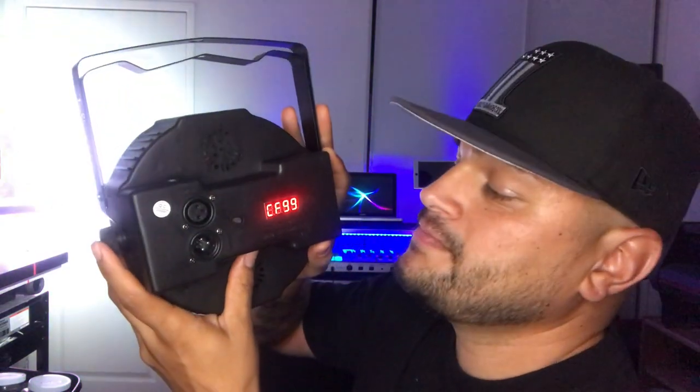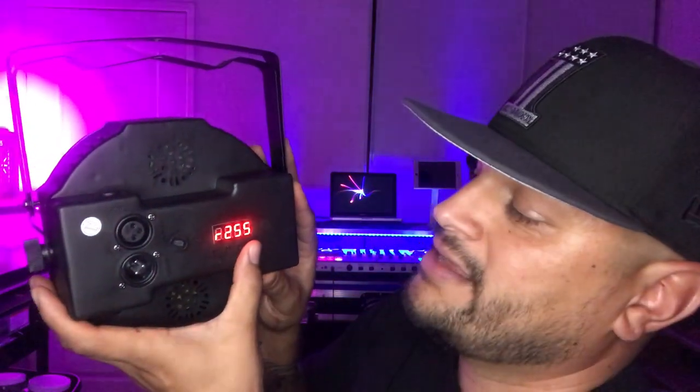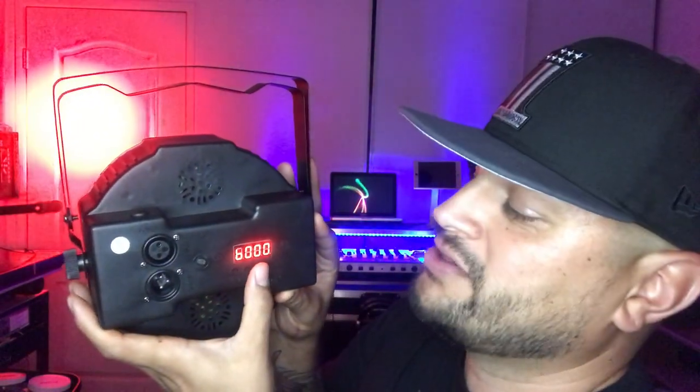So you only have to make changes to this single master light. For example, if you want all your lights red, you change this light to red and all your lights change red. You go to your RGB setting, push enter, and R means red — set it to 255 for its brightest setting. Then go to green and make sure that's set to zero, then go to blue and make sure that's off as well. That turns the complete light red.